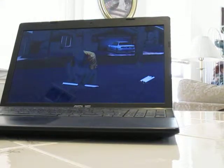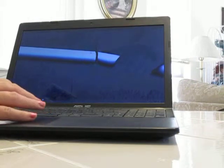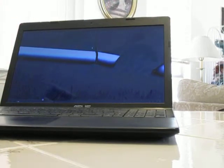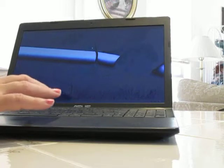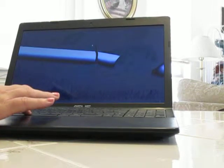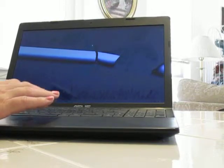A good joint begins with the pipe cut clean and square. If a pipe is cut crooked, it will not bottom into the fitting properly. Now, this is a really expensive tool he's using there. They've got them about this big around, and all you do is twist it. This probably costs $10 or $20. This thing I'm talking about is about $3 to $5. So it's up to you. PVC is a little bit harder to cut than copper pipe, but copper pipe's more expensive.